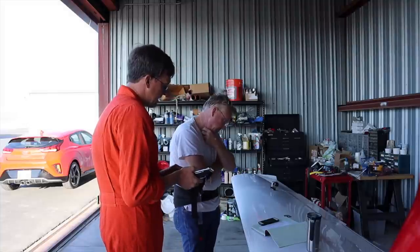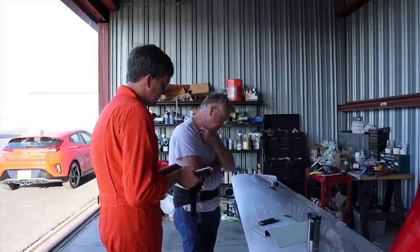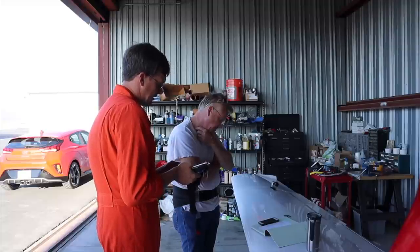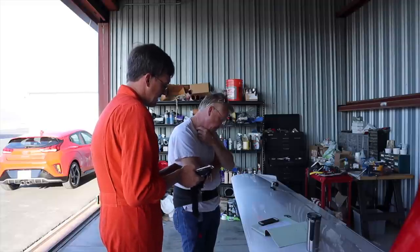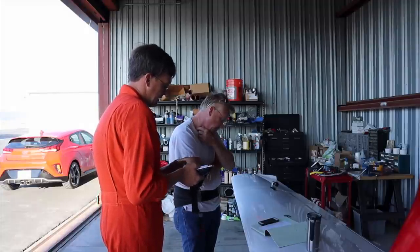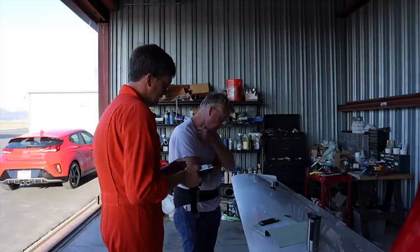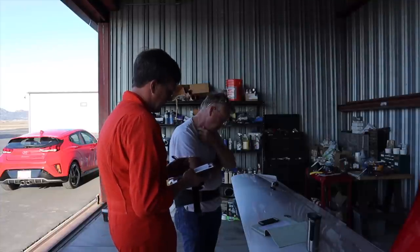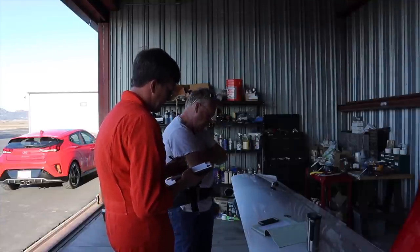And then same thing for VA. 143 was what we had used previously. And the indication you wanted? No, that's good. Okay. And then our new VNE with the error is 259. Limit load factor, 3.8. We're not going to get over 2.5 today. Okay. And then the limit for the flaps doesn't matter. Yeah. But it's there.